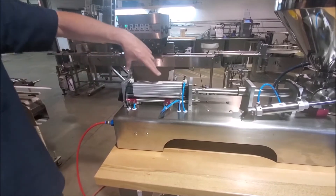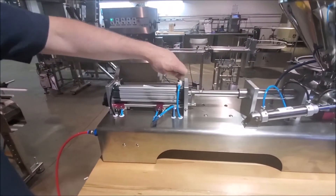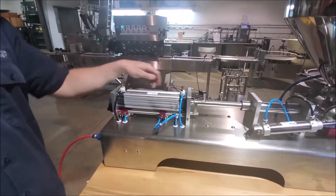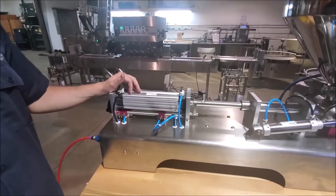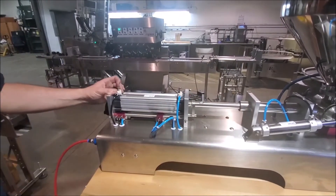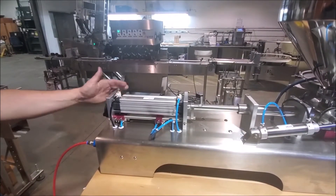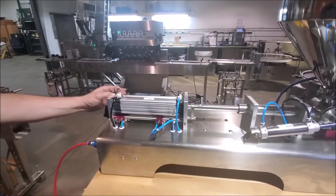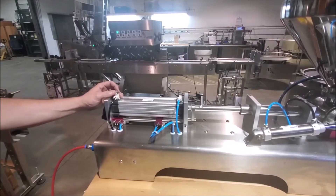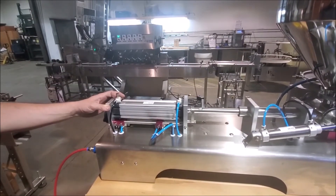There are a few flow controls on our air cylinder here that's running our piston. These are going to allow you to stroke faster or slower on your return and your forward. The front one is for your forward stroke — that's going to change how fast the product is dispensing out of the nozzle. If you're getting a lot of splashing, you might have to turn this down. It'll be a little bit slower fill but won't splash around on you. The back side is for the return stroke — when you're filling up your product cylinder. For thicker products such as lotions or anything that's not a thin water-like product, you want to run your return stroke a little bit slower, because with thick product you don't want to entrap air if you're moving your cylinder too quickly. So if you're getting inconsistent fills with a thicker product, try slowing down your return stroke to get a nice pull through that cylinder and fill it properly without air bubbles.